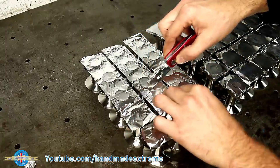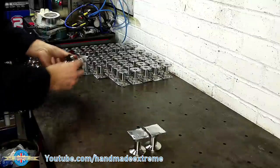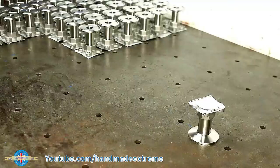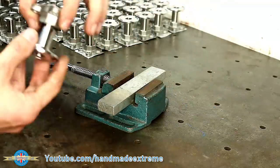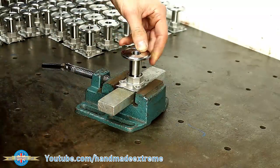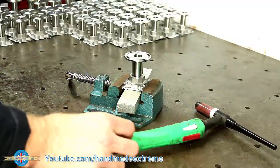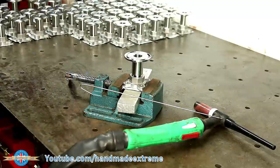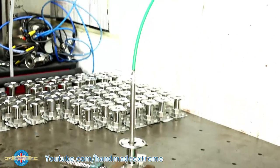I can then just quickly go around with the Stanley knife and cut it into individual pieces. I flip all the fittings over so there's a little bit of weight on the tape, and it also makes them a little bit easier to handle once I've got my welding gloves on. I just use this clamp with a small spacer in it to hold the parts while I'm welding them. I have to peel back the tape ever so slightly just to make sure that you get a good earth connection between the clamp and the part. I'm going to be welding with DC TIG at about 70 amps, with a 1.6mm 2% lanthanated tungsten and a 1.6mm 316 filler. Here's the purge pipe — just a little bit of stainless tube connected to some airline that goes back to a flow meter on the gas bottle.